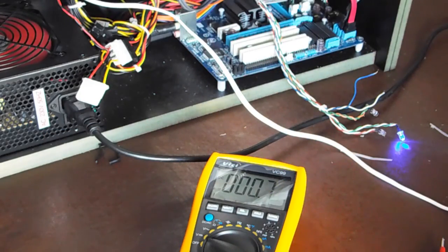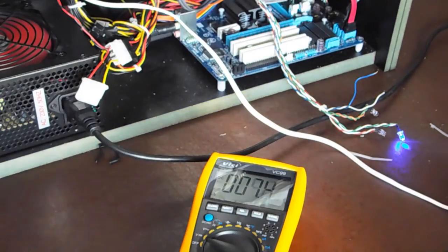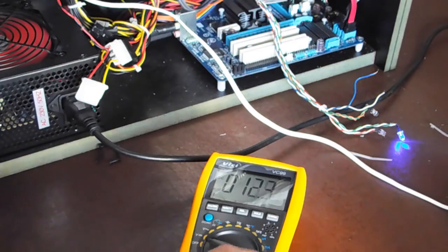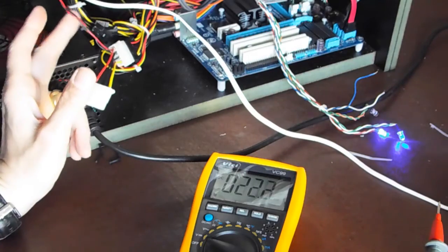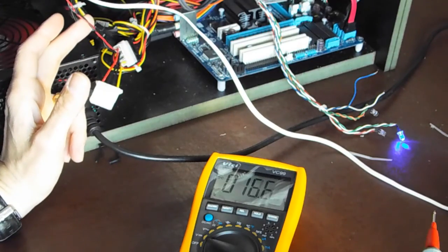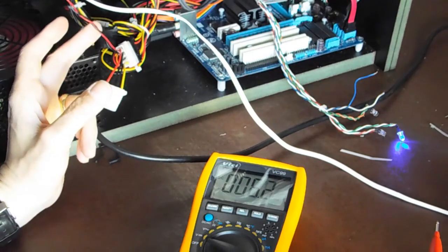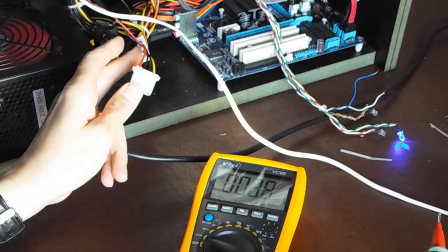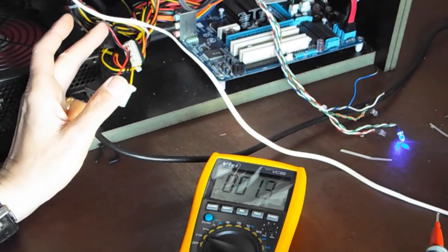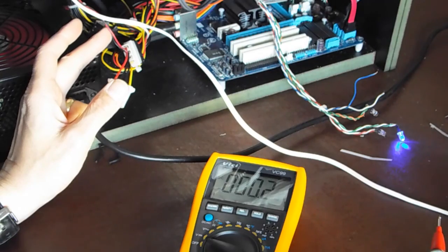Right, I said I'd show you the mistakes that I've made, wouldn't I? And, well, kind of egg on the face here. No, seriously, I'm going to show you a mistake I've made. When I powered up this amplifier, this is the little eBay amplifier, I just used one of these piggyback terminals on the power supply, and the feed out was the red and the black, so I just assumed, I didn't check it, I just assumed that would be 12 volts out.